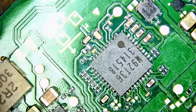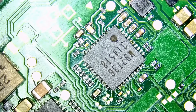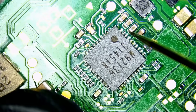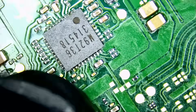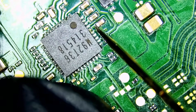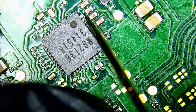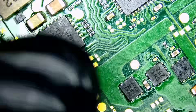Let's measure and test to make sure the M92 is good. We're checking for a short circuit — a common fault on Nintendo Switches. We'll do the same for the BQ chip. Multimeter on diode mode — measuring here, here, and here. No short detected. Jumping over to the BQ chip — measuring all points — no short, no short, no short.